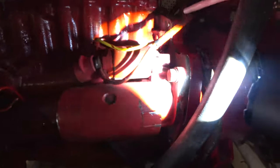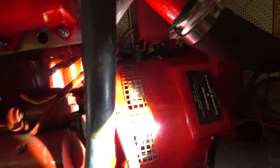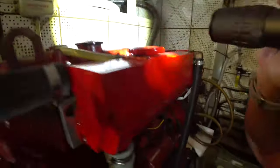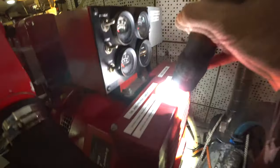Now everything is put back together and running great. I'll just summarize quickly how the process went. All together, to get the armature and stator off, it should take you no more than a day as long as you don't have to go cutting bolts off. There are about nine or ten main bolts that go around the perimeter of the stator housing to the engine block. There are some wires you've got to disconnect—a battery cable and a small cable. You have to take your control box off—that's where the gauges, start, stop, and preheat are. There are four little bolts at the bottom you remove and you can set that off to the side. This plate here comes off.